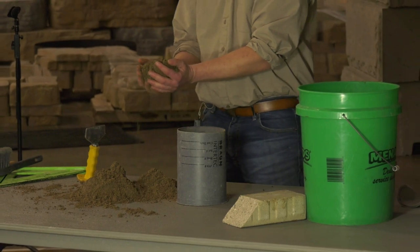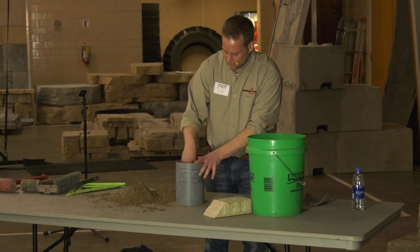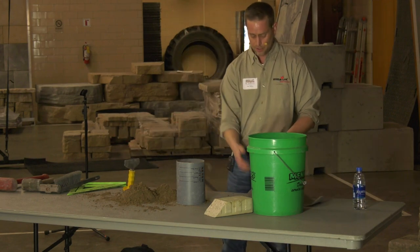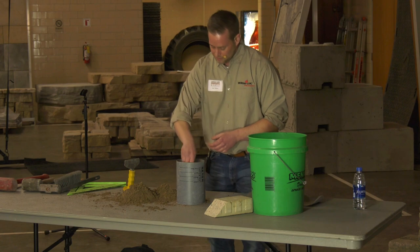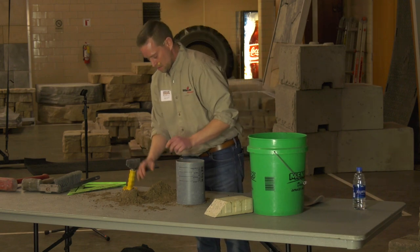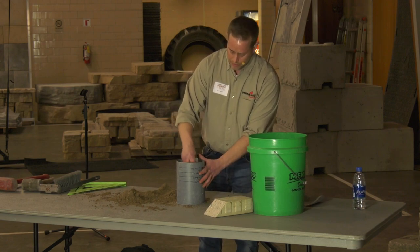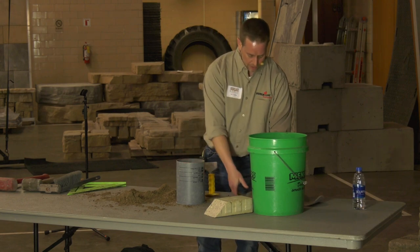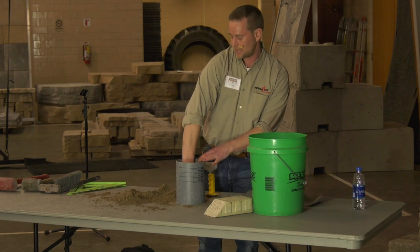Now what we're going to do is do it the right way. We're going to backfill our wall and compact in lifts the same way we did before, but we're going to introduce these little circles of weed fabric — these denote geogrid. You'd never use weed fabric behind a wall, but for the purpose of demonstration it works well. We're going to set our grid in, run a little more sand, and start compacting this material again. This is the same as packing in 2 to 4 or 6 inch lifts behind the retaining wall — running our vibratory plate packer right up against the backside of the wall to achieve our 95% of standard Proctor.